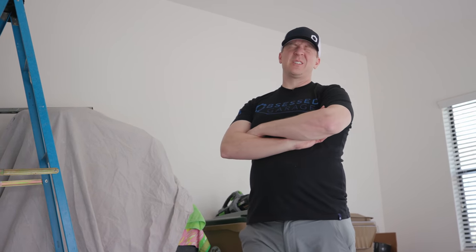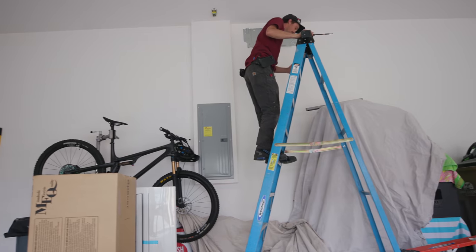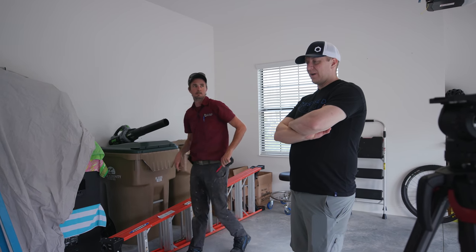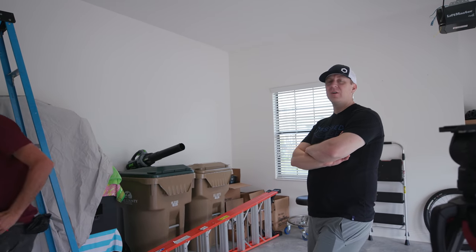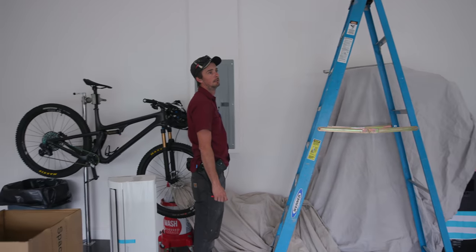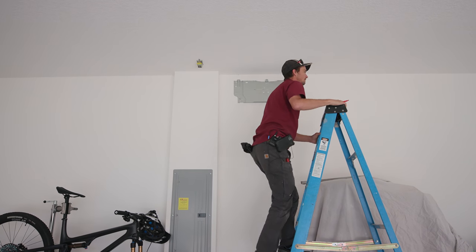I called about my cabinets — I'm doing nine, six-drawer units. I'm going to do a 30 inch in that little pocket there, two 48 inch, and I ordered an extra 48 inch that I'll probably put somewhere else, all in silver. Normally they do 24,000 BTU units, but we did a slightly smaller unit, which means it'll work a little harder and provide a little better dehumidification. You can oversize the air conditioner and then it doesn't run enough. Smaller system, longer run time, better dehumidification.